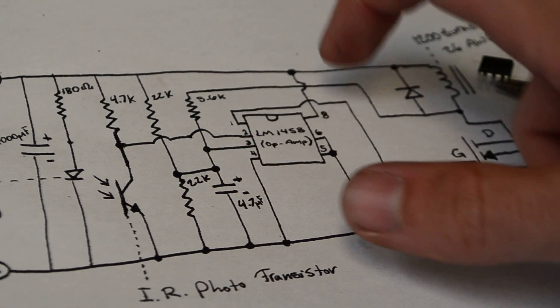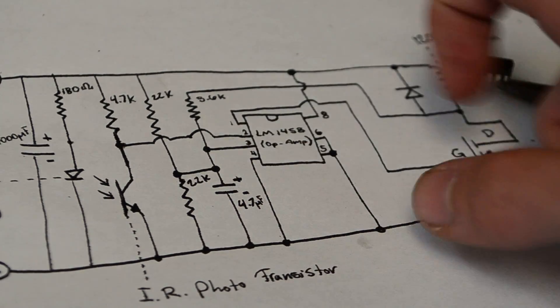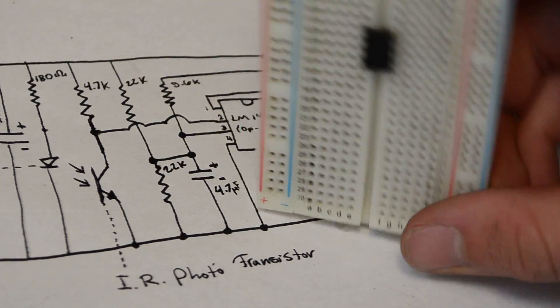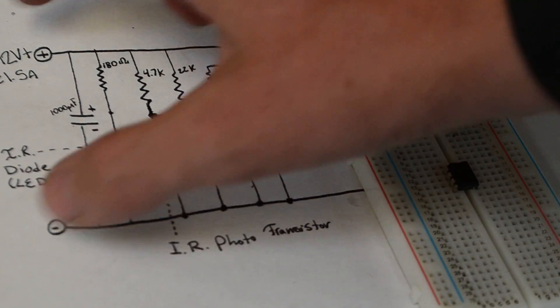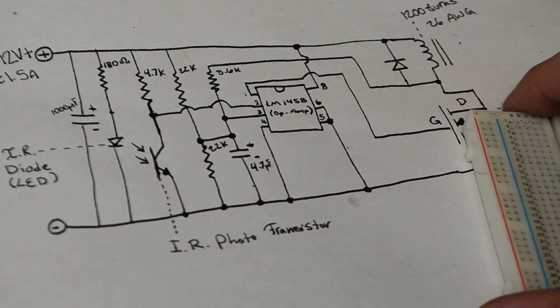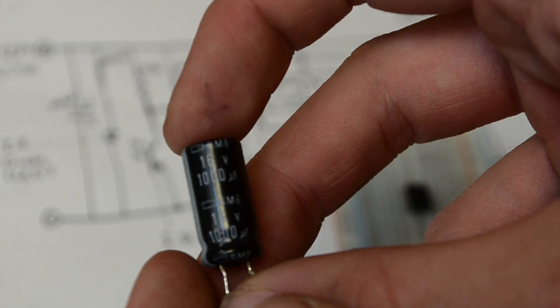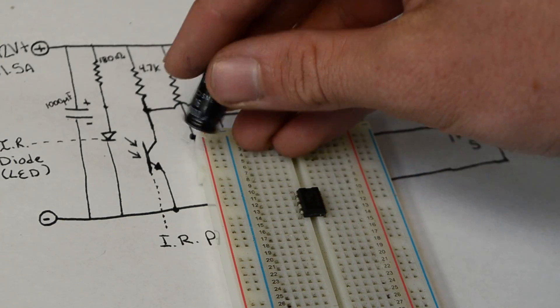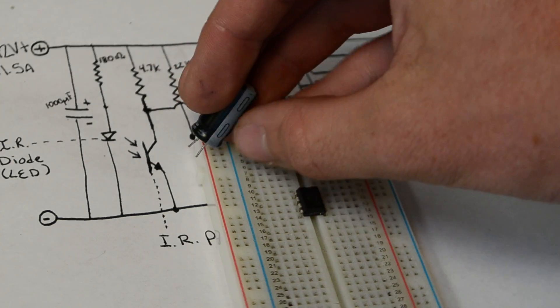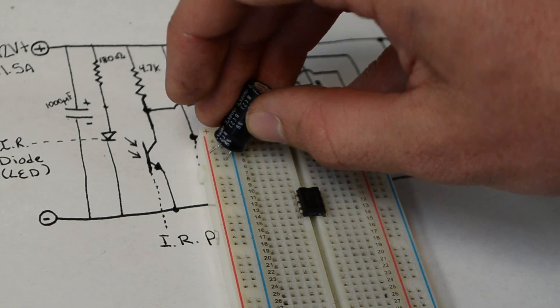At the top of the op-amp there's a little divot, and the pin-out goes pin number 1, 2, 3, 4, 5, 6, 7, 8. As you can see on the schematic, I have it written out showing which pins are which connections. I'm just going to insert this op-amp into the middle here so each of the pins will be on their own distinct rows. To complete this circuit, we're going to work our way through the schematic from left to right. First, to help stabilize the 12-volt DC input, I'm going to add a 1,000 µF capacitor between the positive and negative rail. Electrolytic capacitors like this are polarized — this side is the negative and this side is the positive. Next, we're going to insert a 180-ohm resistor into the positive rail. Since I don't have a 180-ohm resistor, I'm just going to use a 200-ohm. If it doesn't work that well, I'll probably change it out for a 150-ohm.